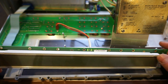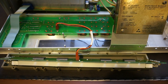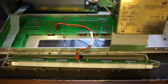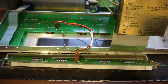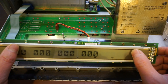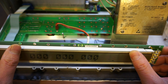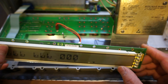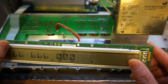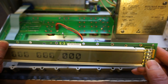Let's see how bright these are first — let me power it up gently. Okay, it's booting up now. I don't want to touch it — that distortion is normal because pressing the frame makes the zebra stripes make nice contact. But as you can see, these yellow LEDs are extremely weak. I think if I change these to white LEDs they're going to be much better.